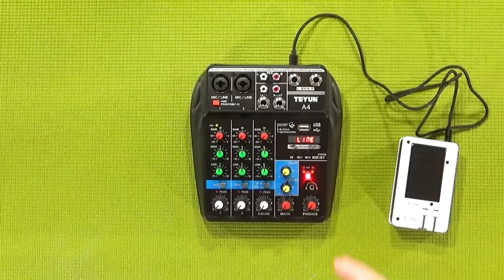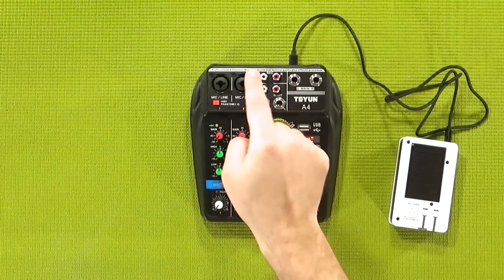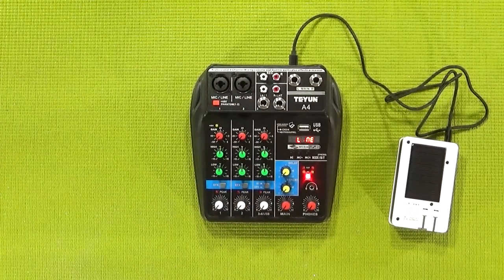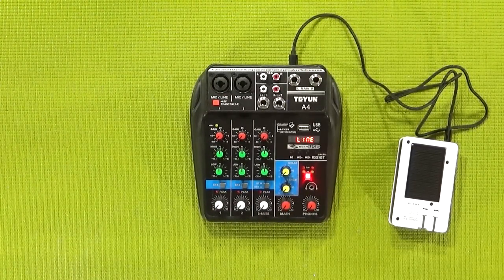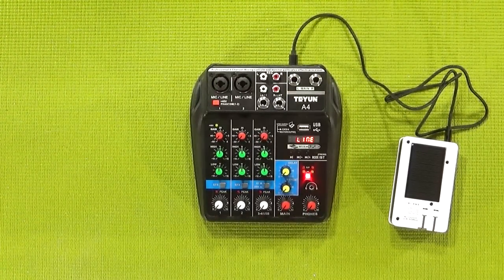I should add that the audio coming out of those ports is going to be a little bit quiet, so you're going to want to plug it into a preamp before sending it to your speakers. As for input limitations, everything outside of XLR is going to be insanely quiet, and that includes the quarter-inch portion of your combo jack. These ports don't provide their own power, so you can't use a jack-powered condenser mic — kind of like a lot of the cheaper lavaliers for phones, or the condenser mic built into the handle of a selfie stick. For what they will accept, it would be a good idea to make sure the signal is pre-amplified. You can use a dynamic microphone because they generate their own power at the capsule, or a battery-powered condenser mic, but you're barely going to be able to hear them. Though if you have a dynamic microphone that works over XLR, it's going to sound perfectly fine.